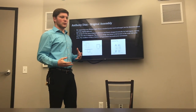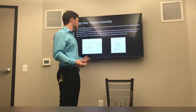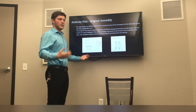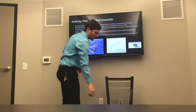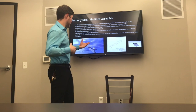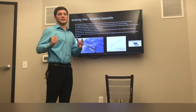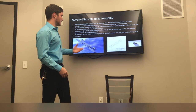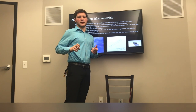I was tasked with the arms and the screws. For the arms, the main change was the part that connected the two arms — I needed something that could pivot so the table could close and open freely. My initial design didn't work because it was too prone to failure. Eventually I found a solution inspired by how a ladder opens and closes — there's a metal piece that keeps it from reopening. I copied that design with my own modifications, using little pins on each end to attach into the table. The hardest part was finding the correct constraints and hole positions inside the table. Here's a formal drawing of what it looks like flat and open, and here's the screw I designed to attach the legs that Katie designed into the table itself.